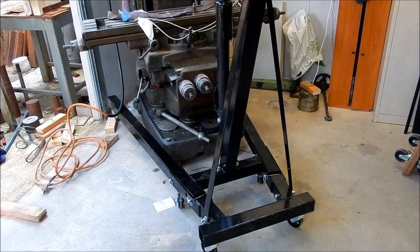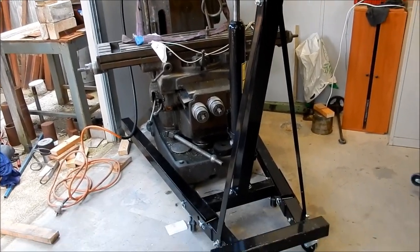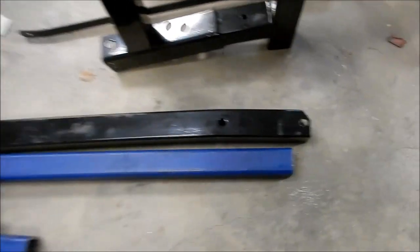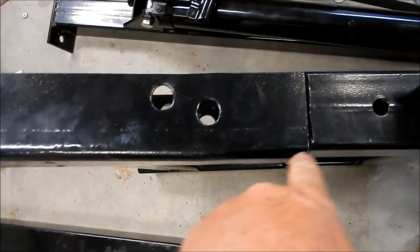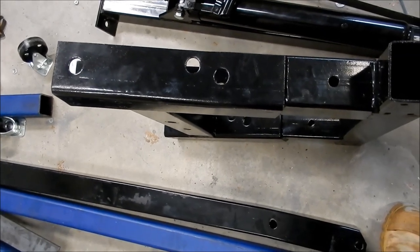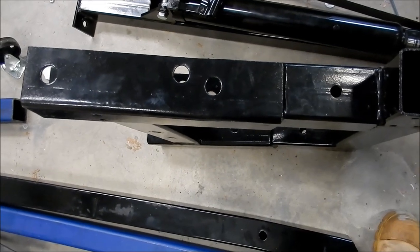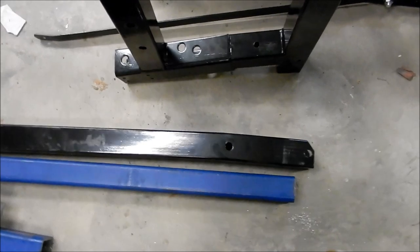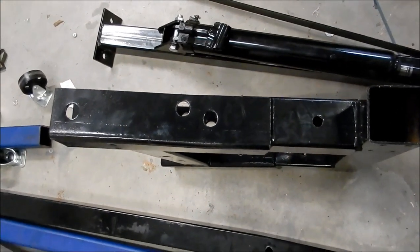We'll wrap this video up here. I'll get the new legs made up and get them into place - we'll just keep going until we get a stable arrangement. I've taken that leg off - you can see there's quite a bow in it. The other issue is it's also put a bow in the frame here, which is a bit hard to see. I can't fit it in my press so I'm going to take it over to my brother's workshop and use his big press to straighten it out. I'm going to plate the bottom and the side of it to make it an awful lot stiffer. It might have been better to rebuild a whole new one from scratch rather than buying this thing - anyway, that's the problem when you overload things. We'll get this sorted out and move on.